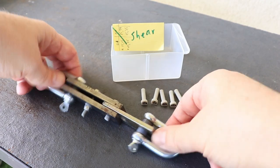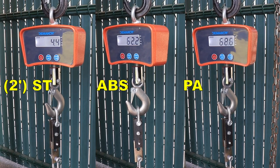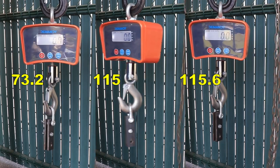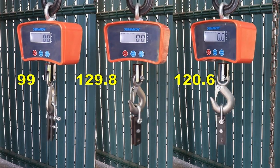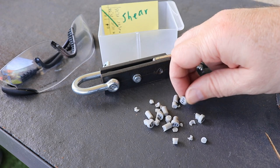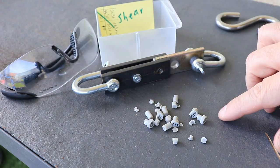The next is shear stress, where I will shear this object into two parts. The diameter is 5mm. Here you can see again the 2-minute cured versions, and then 20-minute cured versions. They completely behave differently from FDM filaments because they snap too quickly. As you can see they are not sheared cleanly on those two areas, but they snap and broke in several pieces.